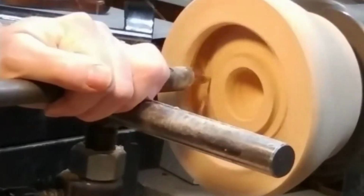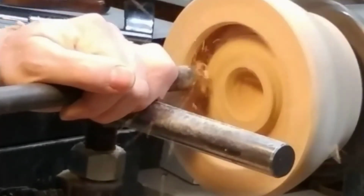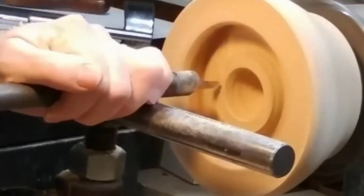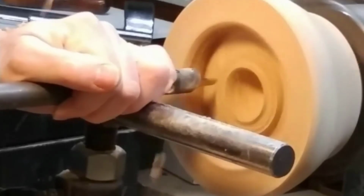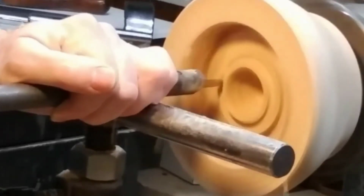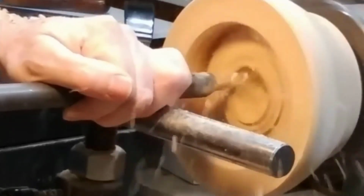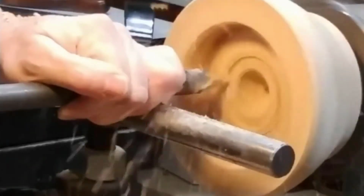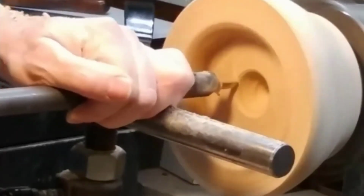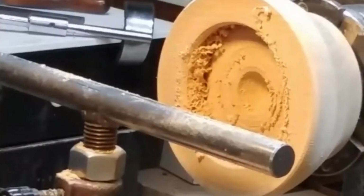But the Kelton hollower is a little bit different. That's just regular steel with, maybe, a 16th inch high speed steel cutting surface soldered onto it. So if you were honing the top, you'd eventually wear it out. So you'd have to use the bevel, touch up the bevel only. Now with those Keltons, I don't sharpen those more than once or twice a year on the grinding wheel. I usually use just the honing, and I'm happy with that.